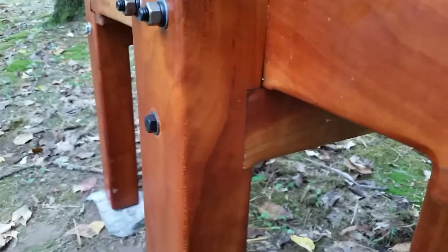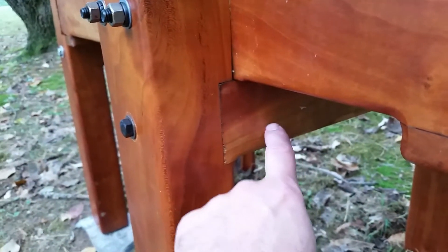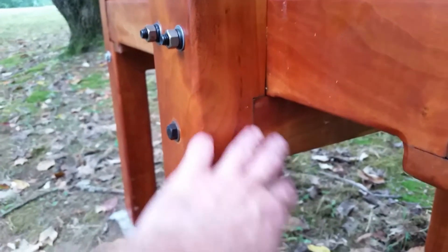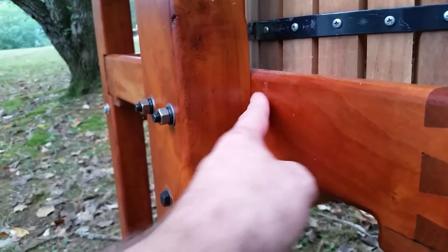It's very important you have heavy, heavy joint woodwork and joinery. Up here on the front as well you can see the housed mortise and tenon joint. All the pressure from that screw is being screwed down through this structure, so you have to have very strong joinery in place. All the pieces, in addition to the woodworking joinery like this casework here, are held together with heavy bolts.